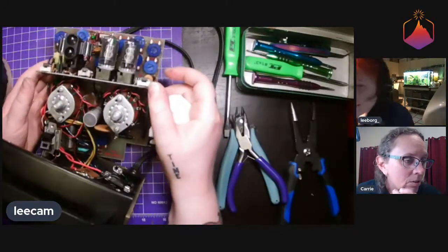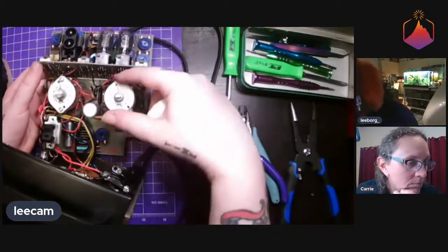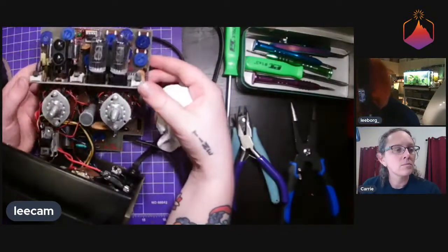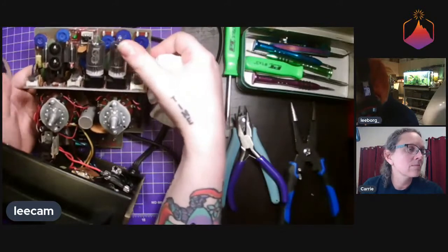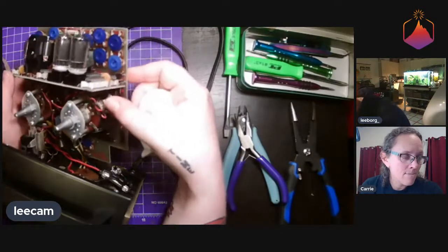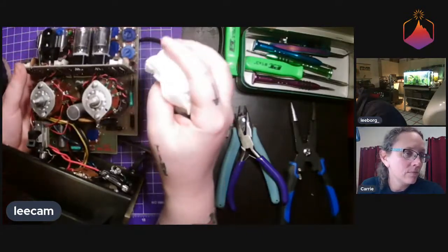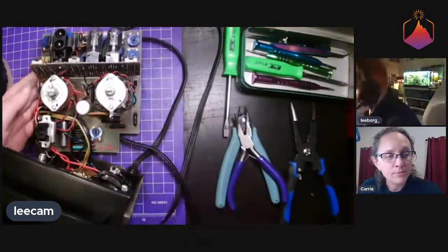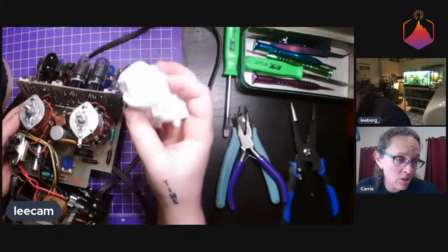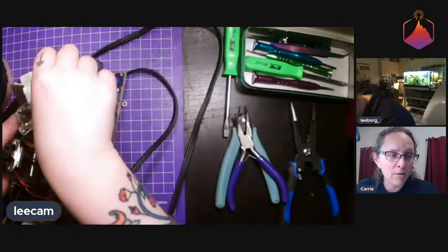Yeah, I was kind of just thinking that, on the top, kind of right up here, this platform's kind of wiggly, and there's a whole bunch of wires that attach to it. When I had it plugged in, I was pressing it like this, and that was causing some glitches. So I think that's a pretty good bet, that it's one of those. So I got my multimeter here, so I'm gonna do a little bit of cleaning, but then maybe I'll test a couple of those and see. But I think after visual stuff, after continuity checks, then you're in the realm of starting to power it on and poke around carefully.